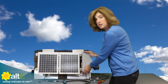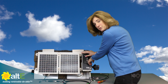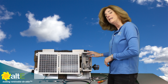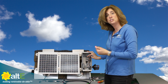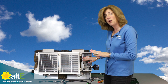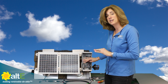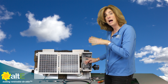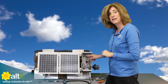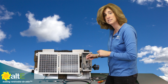I'm going to go into my combiner box — in this example I'm using a Midnight PV3 combiner box — open it up and take off the cover and the protective faceplate to make it easier to work on. I've got a breaker in here; depending on your system you may have a fuse. Keep in mind with a fuse holder, you do not want to turn it off if it's connected and there's sun on the panel — you don't want to turn off a fuse under load. A breaker is designed so that you can, but you cannot do that to a fuse. So I've got my breaker turned off; if I had a fuse, I would have it disconnected right now.